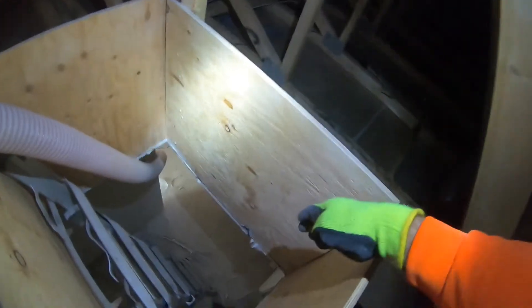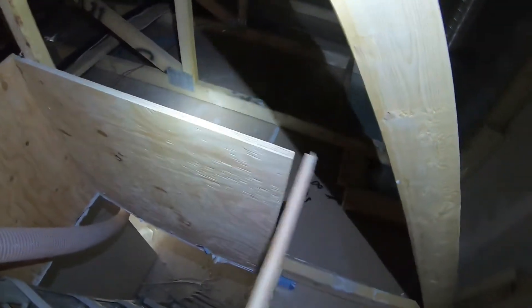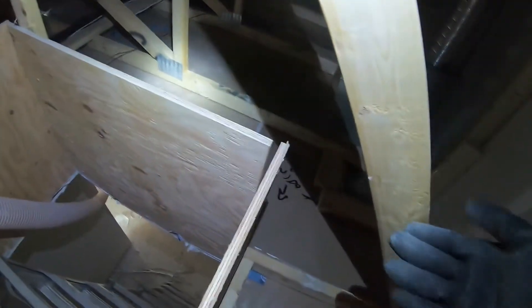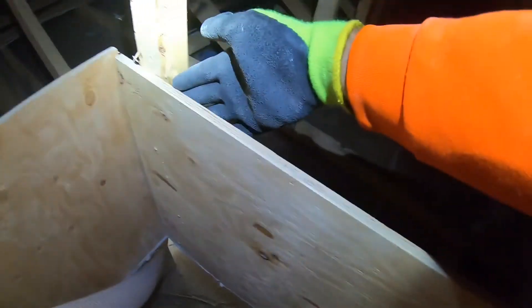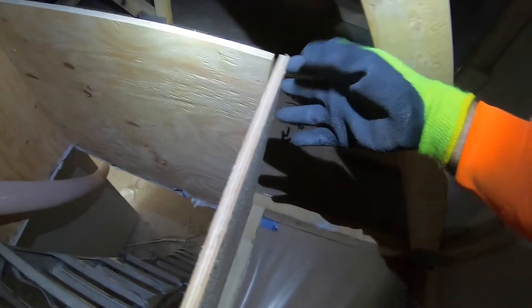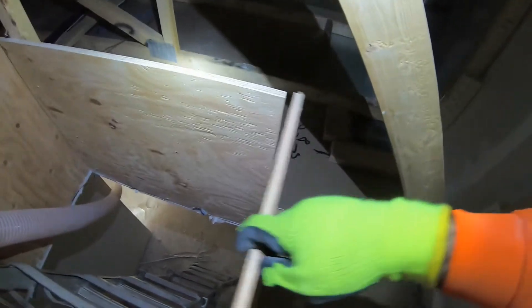The other thing I wanted to show is the attic hatch detail. You see how this piece of plywood is flush with the side — that's good. But look at how flimsy this piece is. You can easily repair this by putting a border of 2x4 right around here that overlaps so you can screw it in properly, and then you won't have this safety issue when you want to get into the attic.